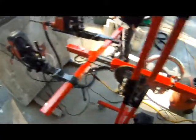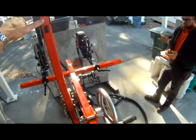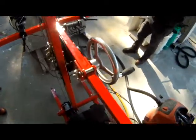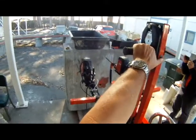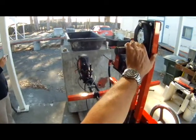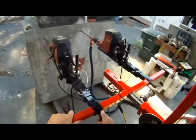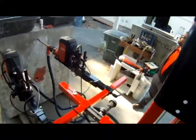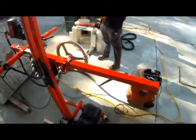And you may have a run of these, so when you're in relative position, I'm gonna pull it back just slightly to make sure we clear the holes properly when we're finished drilling, because we're gonna drill those two holes, then we wanna traverse down to the next set. And the idea is that we've got a lot of these holes to do. Make sure these are all fixed. And let's drill a couple of holes.